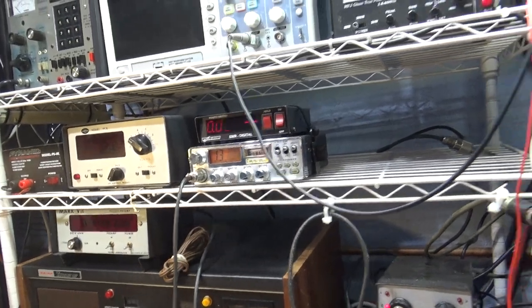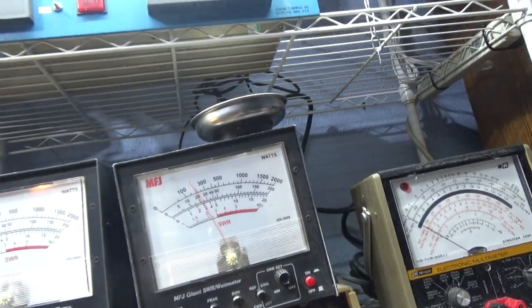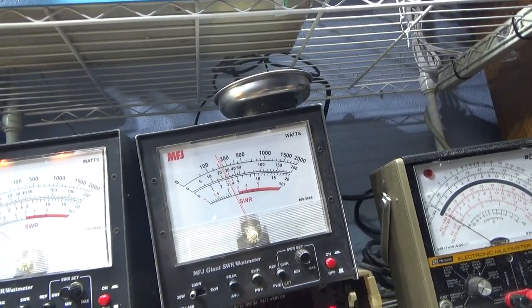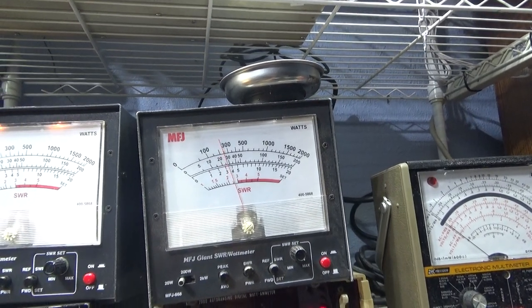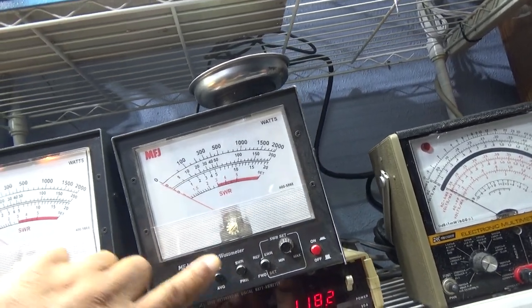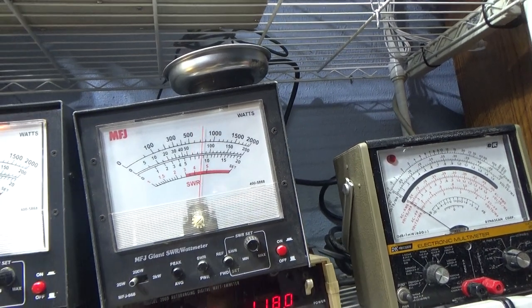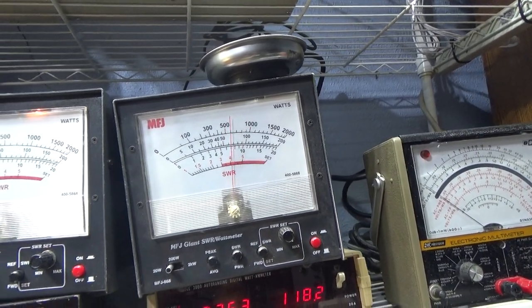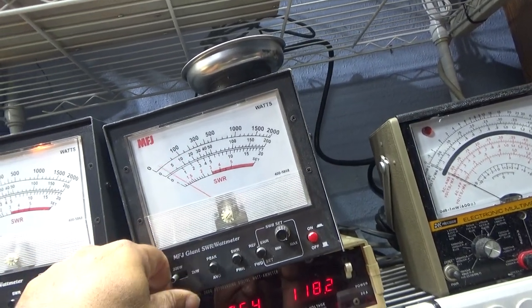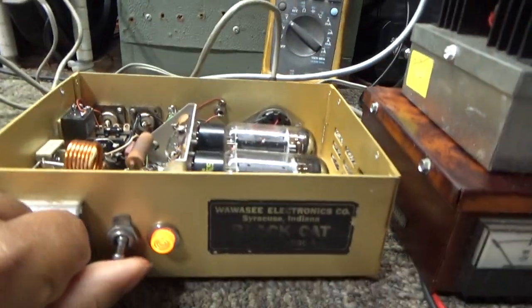We're warmed up, putting it on standby. The Mud Duck radio over here is hooked up to a dummy load. On the meter: we're dead keying 3 watts and swinging about 7 watts RMS on audio. It might hit 12 watts peak. So that's all we're putting into it with the Mud Duck radio. Now we're on the 200-watt scale on average — let's fire up the amp.